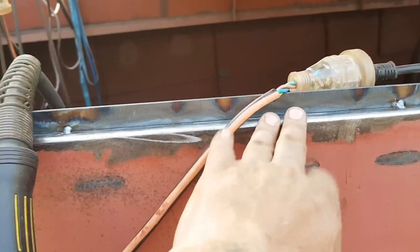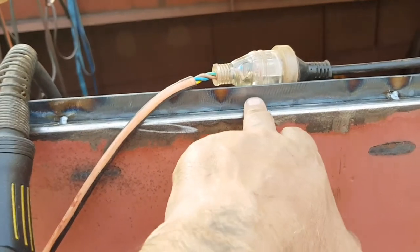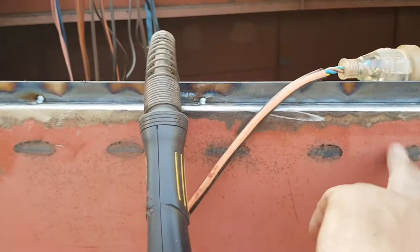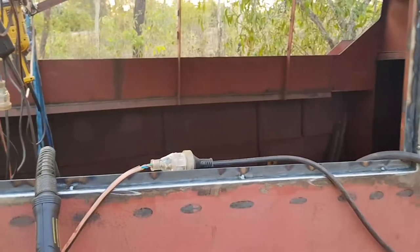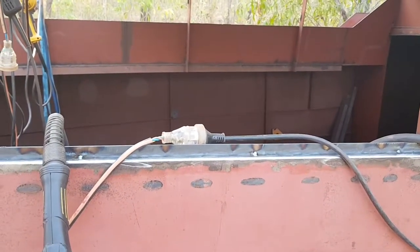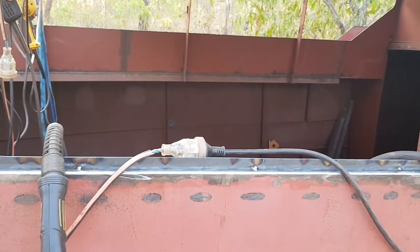I can then tack-weld into position and use the ends of those tubes as reference points. I keep the ends of the jig frame at a set 15mm depth from the forward and aft ends of these vertical beams, and the horizontals have to be flat both top and bottom in line with that. It means the depth in the centre is slightly more than at the front and back because of the curvature, but once the windows are in and sealed with sealant you won't even notice it, and the flat windows will give a much nicer view from inside.